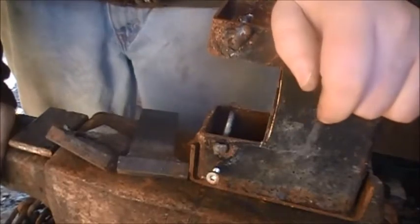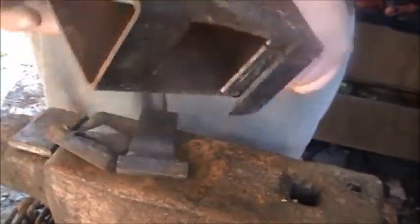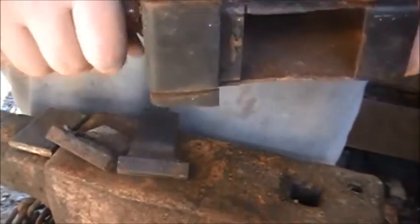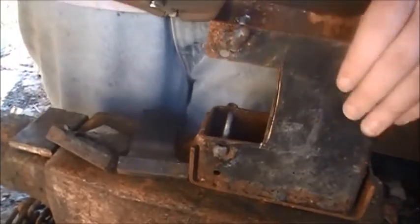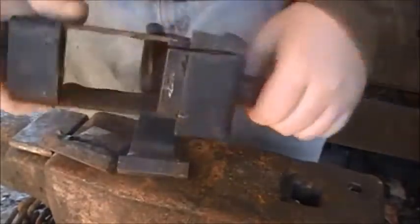Let's talk about how it's made. I started out with a piece of two by five channel — I had a bunch of it in my scrap pile and it already had this bottom plate welded onto it. I forged out a hardy shank to fit in my hardy hole to keep it locked in place so it's not going anywhere. I cut a two and a half inch across channel in the front; it goes about another two and a half inches back. Then I cut a little window in the back.